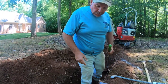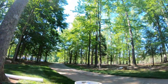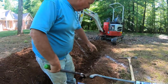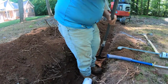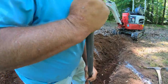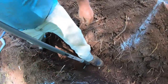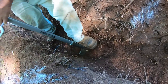Hey guys, it's Marlon. Wyatt touched on digging across these lines right here. Weston and Wyatt located and hooked onto the well over there — we've got a water line and also a 220 line going to the well, plus another line we'll show you in a minute. Right here in this ditch where the line comes across, we're digging in pretty much hard ground. The way you can verify where that line goes — a lot of times when your shovel won't go into the ground, you're in virgin ground. But right where we cross that line, the shovel just goes in like that — that's how you find a ditch line.